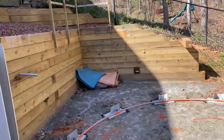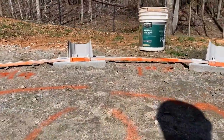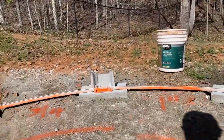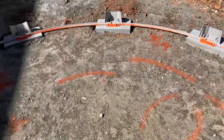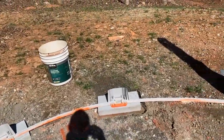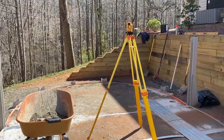But we had a lot of rain. And even though this was excavated well below grade, this area right in here is a little bit low. Those rails should be sitting on the ground. So I've got some stone dust — I'm going to bring it here and tamp that out. It levels out about right in here, so it's just a very small area. You can see where I've marked it. So tomorrow we're going to get this thing flat and everything set in, cover it with plastic, and then I will bring in my 2-inch foam and cut all of it to fit. And then we will start building these walls.